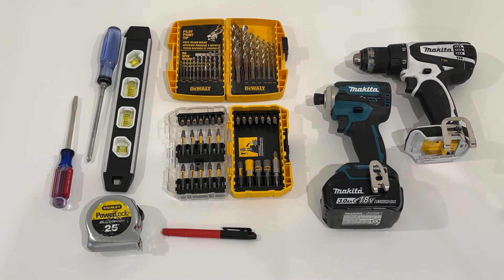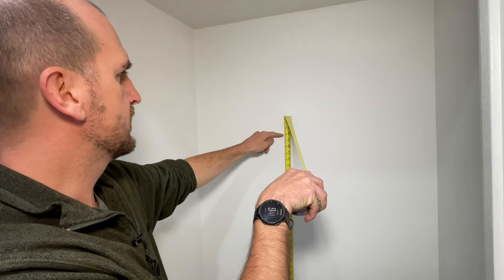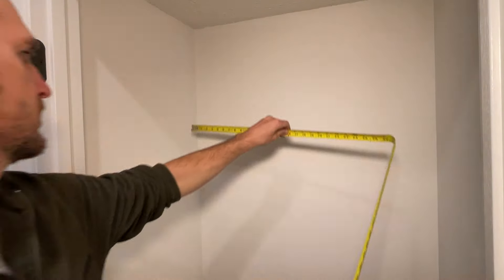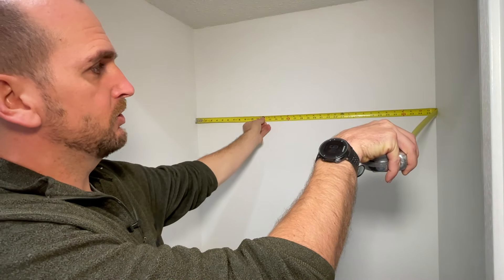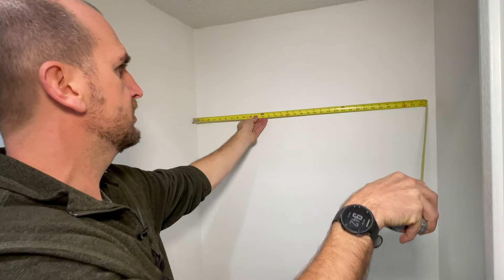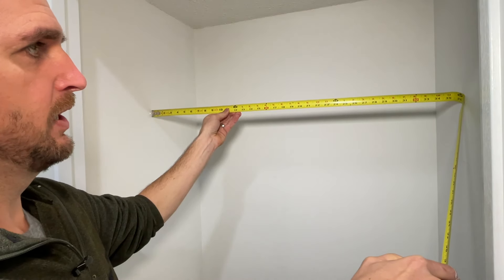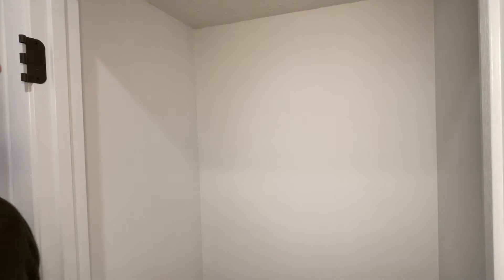Let's take our measurement and start cutting our shelves. I'm going to be installing the shelves at about 66 inches up — that's where the actual rod's going to be, so the shelf unit will be slightly higher than that. This is supposed to be a 36-inch wide closet, but I'm actually going to go 35 and a half to give me about an eighth-inch clearance on both sides. I want to measure at the back of the wall and also come out about a foot to make sure 35 and a half inches won't have interference. So I'll cut the wire shelf at 35 and a half inches.